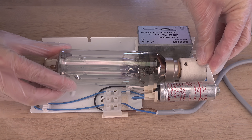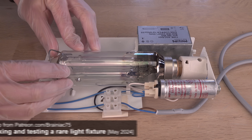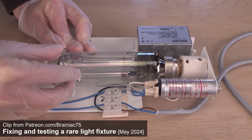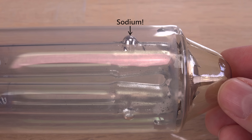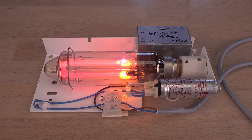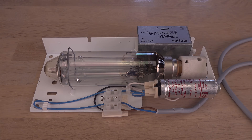This is a 40-year-old low-pressure sodium vapor lamp. I fixed and tested it in my latest Patreon video and it works really well. As implied, it works by vaporizing sodium metal and sending an electrical spark through this vapor. This spark, electrical discharge, gets very bright even at low wattages. This particular model, a Philips mini-SOX, was introduced in 1977.